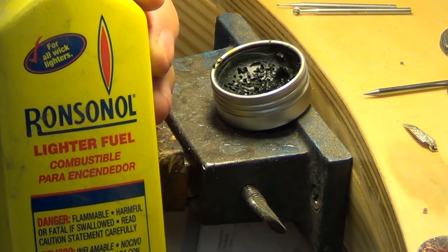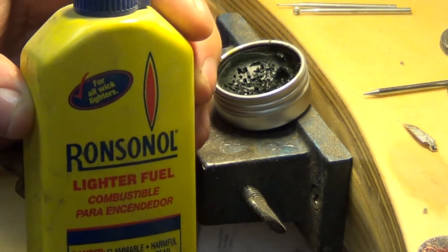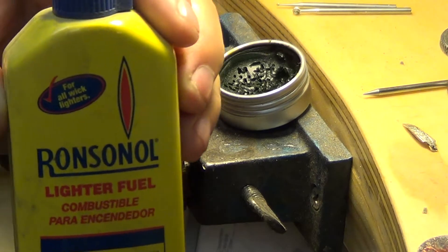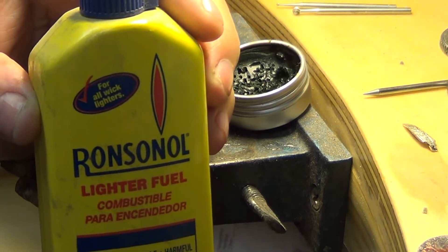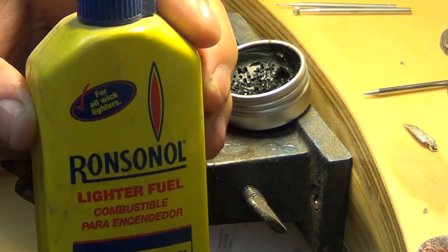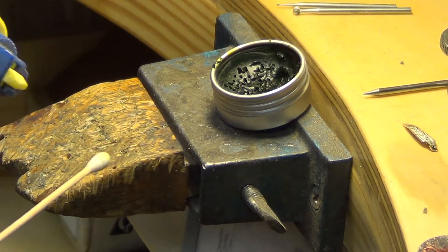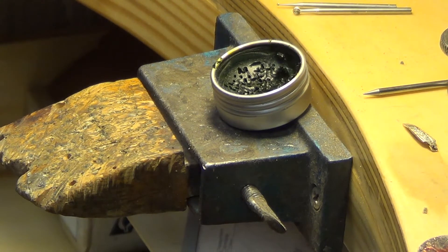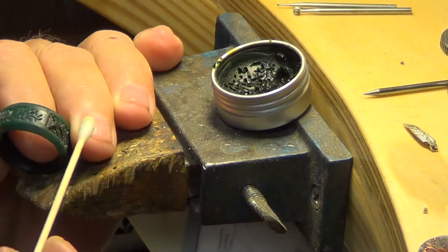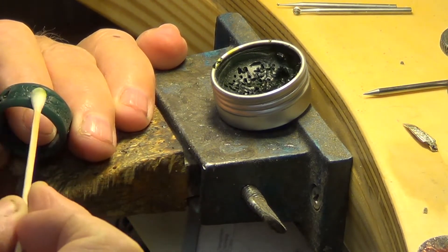The thing is, you can't just saturate your wax mounting because if you do, it will melt into all your crevices and round up corners that you don't want rounded. You can't run this on machined surfaces — like where I put the 30 degree bevel on the edges of the ring — that just has to stay left alone. I'll probably clean those up and redress them after the casting is done. You just take a Q-tip and drop a little dab on there — careful, it is flammable.